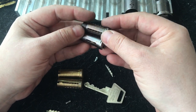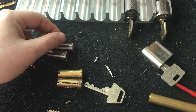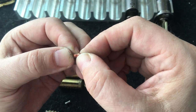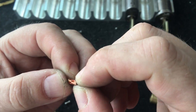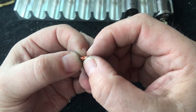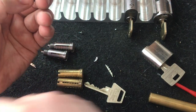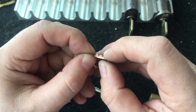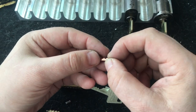There are no security pins on the sidebar, because the sidebar coding is again part of the master key system. Looking at one of these sidebar pins, we can see it has multiple gates - one center gate and one side gate - showing that it still uses the mechanism where the pin turns a little bit to align. This is the short one that only supports 2 sidebar pins, representing the low level of security in the Triton.